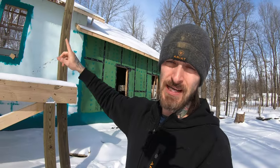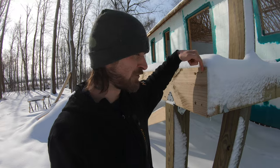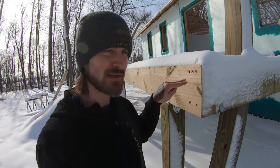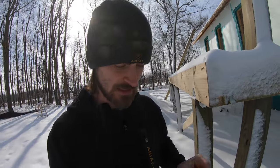The other problem is because we only have a single wooden top plate up there. We need something thicker and heavier duty because you don't have 3-inch nails going down through the top plate, or through a double top plate going this way. But yes, you can use 3-inch nails going this way. So we beefed up the thickness of the steel so that you can only use a 1.5-inch nail going down. And again, that's going to support the LVL going out this way, which will then support trusses sitting this way on that LVL that are going to run across the porch.